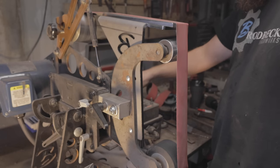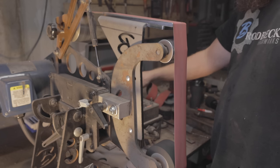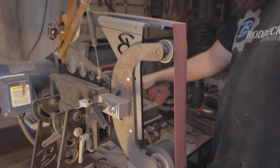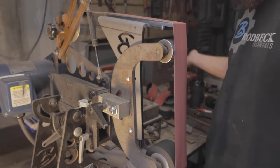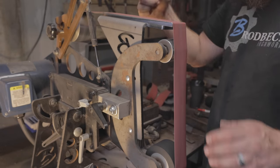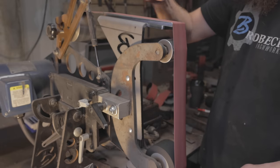Let's put a belt back on and show how I run it. I like to turn my grinder on at zero speed and slowly turn it up — that's about where I use it on my motor, about 30 percent. The belt tracks right in the middle, and the belt is running this way towards you, so it's going to be grinding into your plunge.